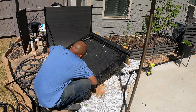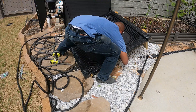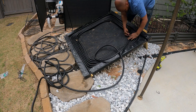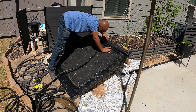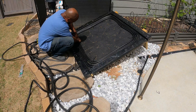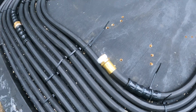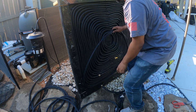This next part took a while — I struggled a bit with the tubing. Looking back, I probably should have let it sit out in the sun for a little while before tackling it. I did pre-drill some holes, though that turned out to be unnecessary. I was able to fit three 50-foot hoses onto the panel. Before connecting each hose I used a little plumber's tape to minimize leakage, then coiled the tubing as tight as I could, with a small overlap.